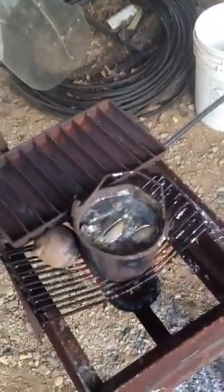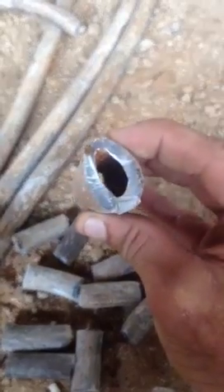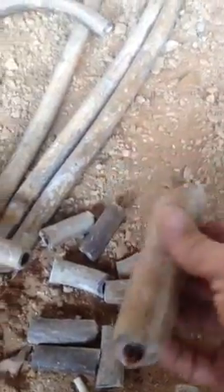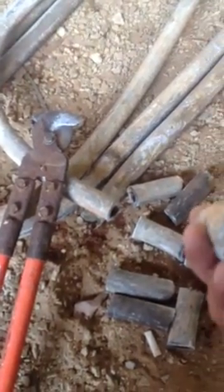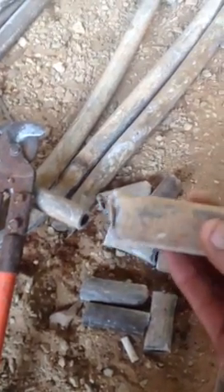Another day of melting lead. I got some old lead water pipe from a friend of mine who works in the water department. As you can see, it's actually lead pipe - yes, they used to use lead as water pipes, kind of ironic. I'm using a cable cutter to cut it. I think it's one inch inside diameter with a thick wall, so probably about inch and a half pipe.